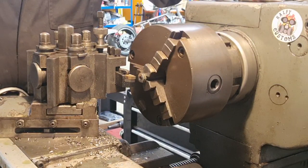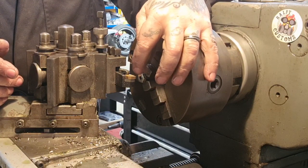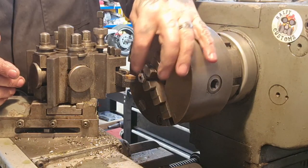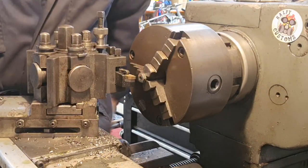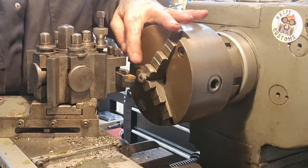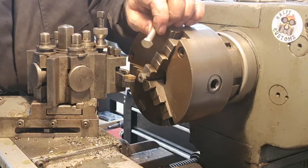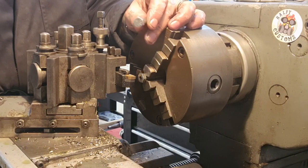Right, now, this is going to be not pocketed. The other half is going to be pocketed. And the total depth of head, the thickness of the head, needs to stay about what it is now to clear everything, which is about 6 mil, about 1/4 inch, for the 3/8 bolt. So I'm going to machine this down, and this is going to be thin, and the one with the pocketing is going to be thick, if that makes sense. Hopefully it does, that's all I've got.